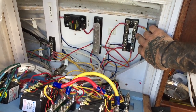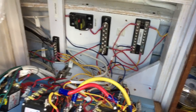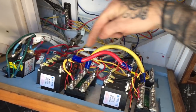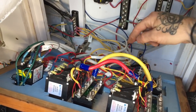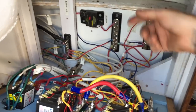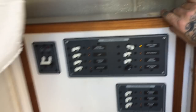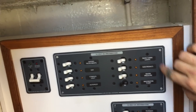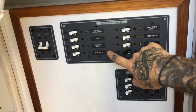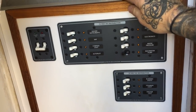There's a lot more to add obviously because I only have one light hooked up at the moment. This is our hot bus that comes off of the battery, so anything that needs to be a constant hot — that's there. We have the hots running off of here into our individual breaker switches, and then all of our elements coming in to the breaker switches so that switches each individual instrument or whatever needs the power. Yesterday we got the main cabin light bus wired up, the macerator pump, running lights, steaming lights, anchor light, the autopilot, and I wired the fuse block for the sailing instruments — there's nothing hooked to it yet but it's wired.